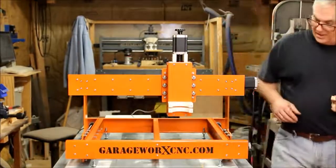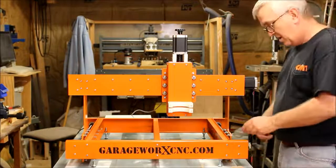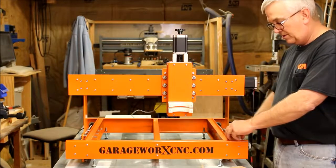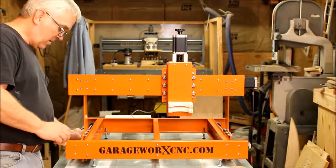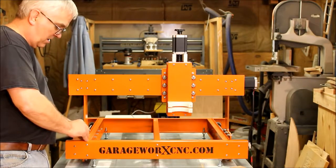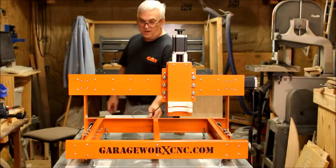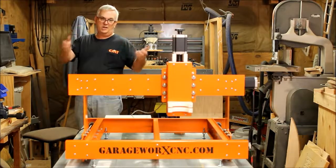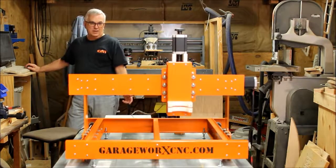I'm going to turn this controller back on and jog it back towards the front. Now I'm pretty close — turn the controller off. Eyeballing it, that side looks closer than this side, which probably happened when I was putting in the lead screws. What you can do is take something — like this three-quarter piece of plywood — and run it to space the gantry out. While the controller's turned off you can actually turn these by hand, so I can set a uniform gap between the two. Now when I turn the controller back on, even if I accidentally jog the wrong way, it's got three-quarters of an inch before it really crashes into anything.